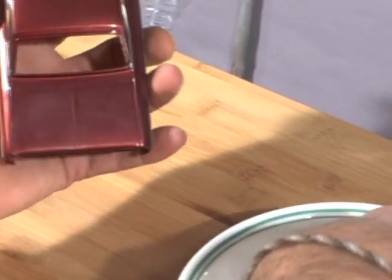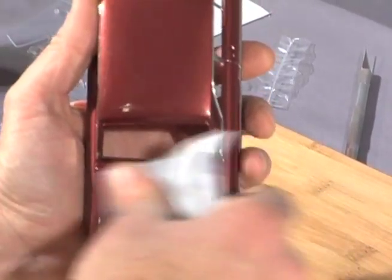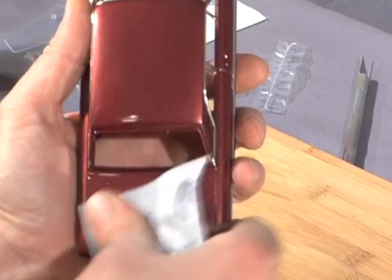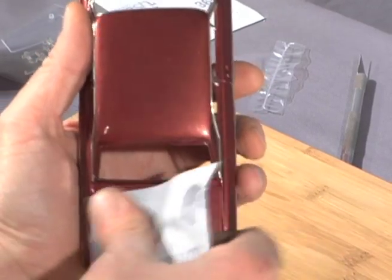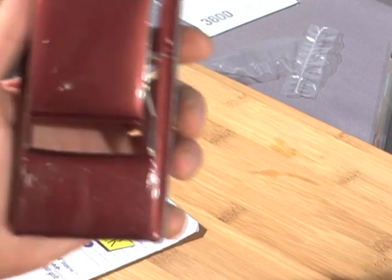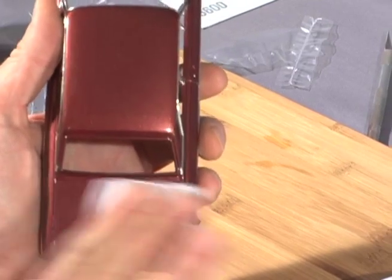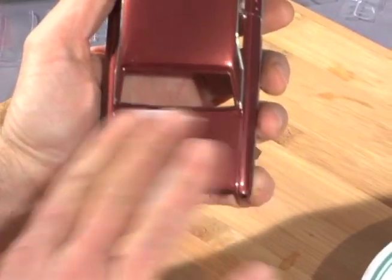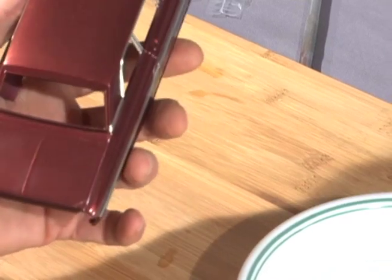Now we're going to go with the 12000 and go over the whole thing — just rubbing gently on it. This way it's all uniform. Okay, now I'm going to dip this in a little bit and wipe it off. Take one of these little chunks of t-shirt and dry it. You've still got a little bit of a haze, but the tiny scratch marks you see in there — you see them? They're going to disappear here in about two seconds.